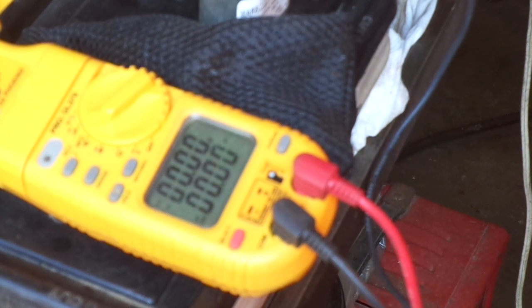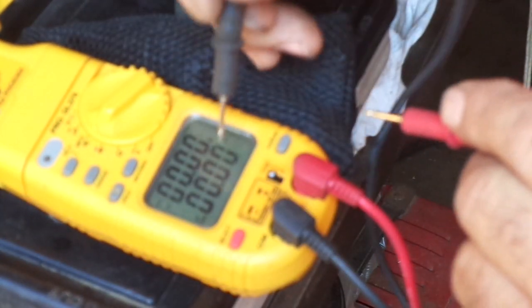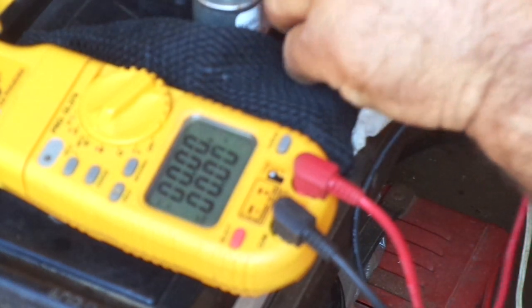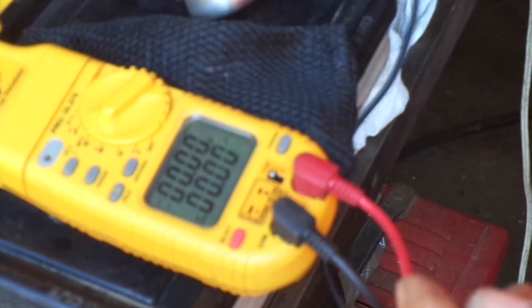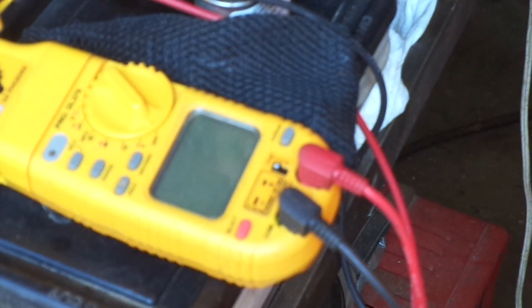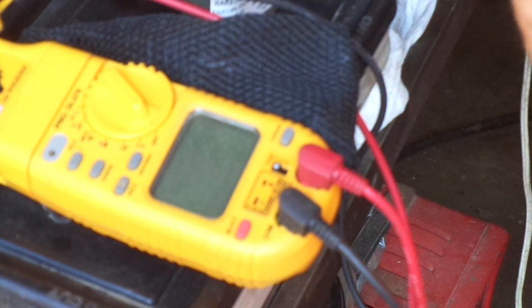If this motor burns up today, it'll serve its purpose to keep us cool while we're working outside in the heat. Back to checking the capacitor — again, the bottom scale. This is a 5 microfarad capacitor. I'll short it out to make sure there's no charge in it, then put the two terminals on there. Watch — it's reading 2.81... 8.45... 5.22. This capacitance reads just a shade over 5 microfarad at 5.2. That's a little bit too much for this motor, but if this was in your basement or on a commercial job, I would put the correct capacitor in. This is one of those 'do as I say, not as I do' situations.